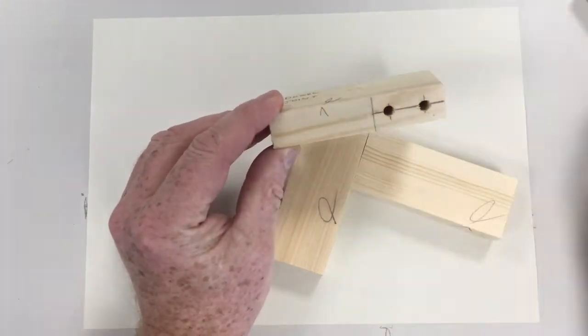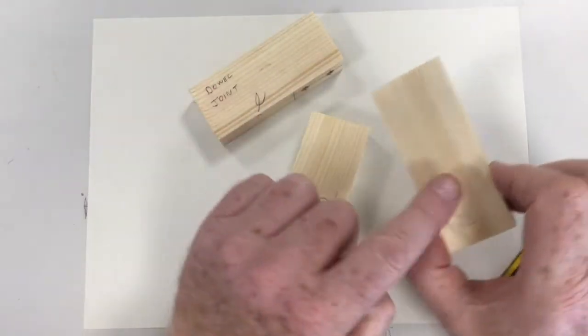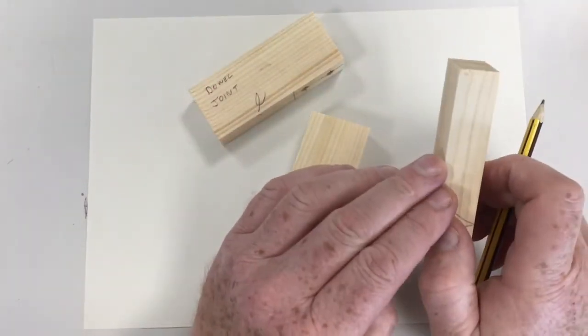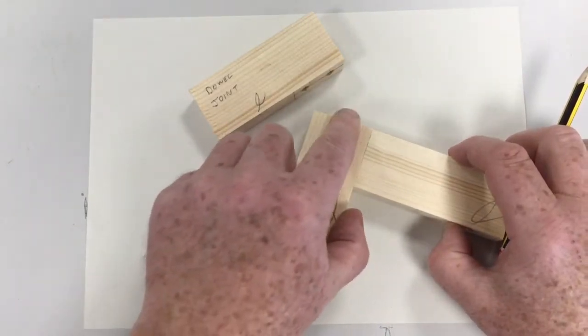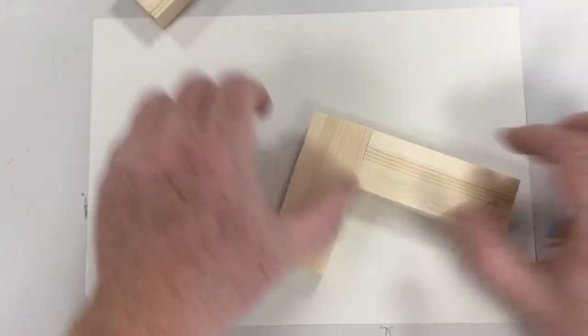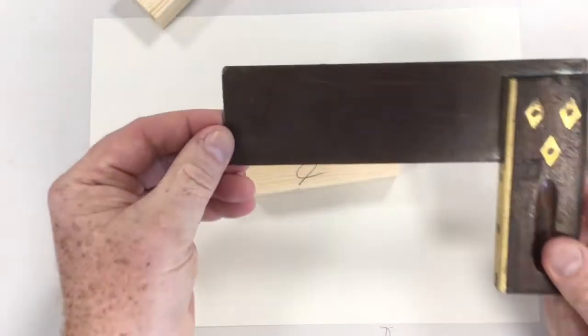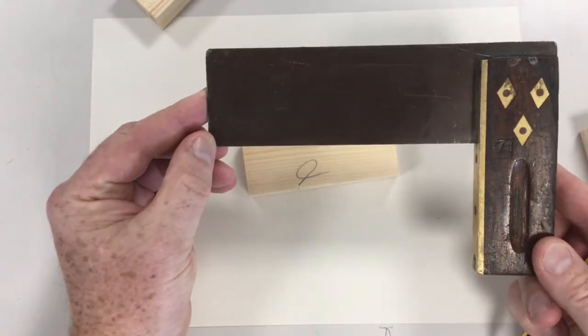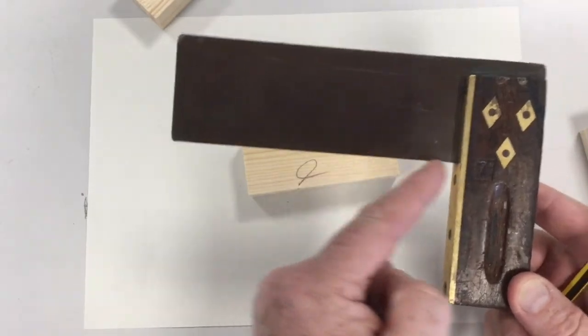So this is the width of our piece of wood coming in. Now, our wood is 40 across and 20 thick. So the first thing we're going to do is mark a line here, 40 down from the top. So we're going to take our tri-square. This is our tri-square, used for marking lines square to an edge. So this is 90 degrees in here.